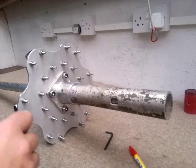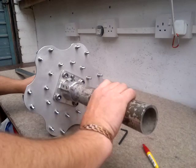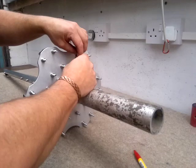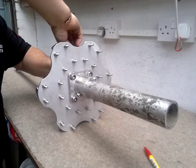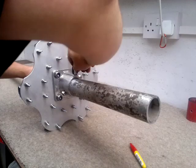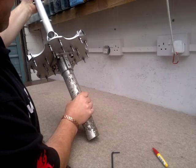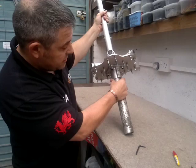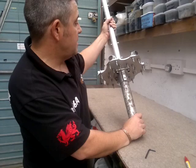Insert the machine screw and tighten up with two 13mm spanners. Tighten the grub screws — top ones nice and tight, make sure they are very tight. This is what is holding the antenna together, so these need to be quite tight. Make sure these are all tight. And that is your stub mast — the larger stub mast — a nice tight fit into the flange. It has to be 48mm, so just look for scaffold tube that is the exact right size to fit inside that flange.